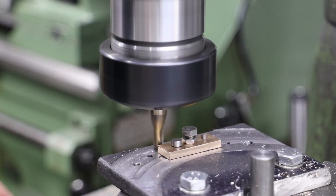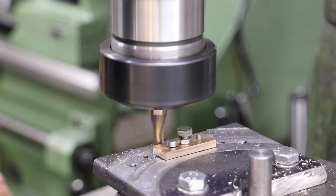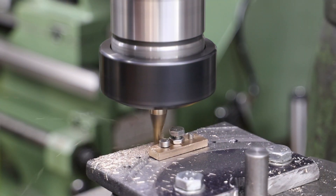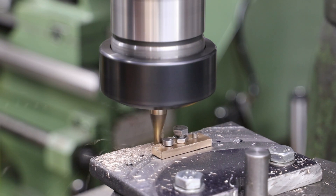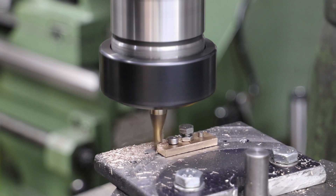I now use a slot drill to cut the larger diameter of the die blocks, but this time I'm bringing the cutter in on the x-axis. As the clamping bolt is wider than the thickness of the die blocks, I have to work around it as I get closer into dimension.